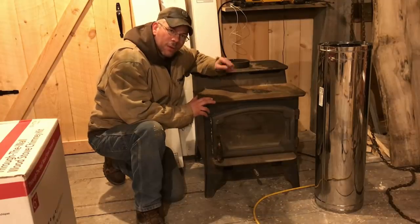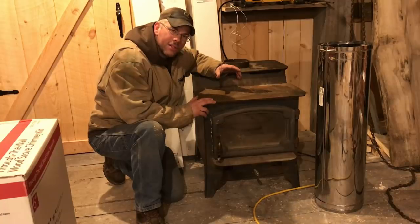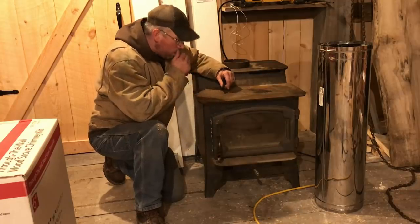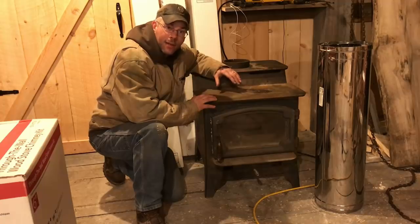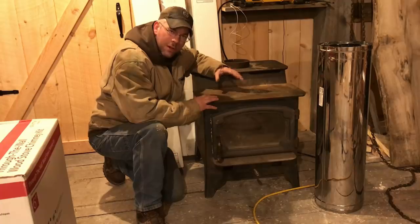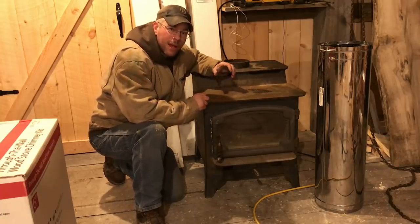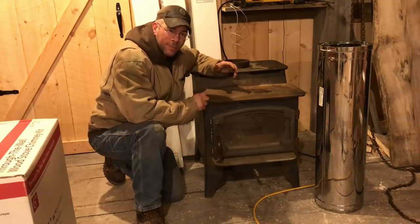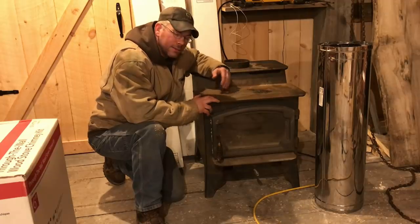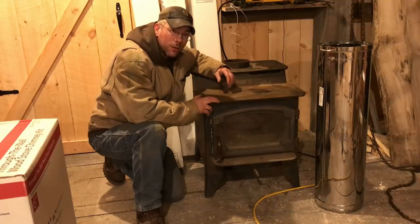The big sawdust burner we're going to put downstairs, because I have a feeling it is so big that it's going to kind of overpower this space a little bit. And I would much rather have that on a concrete floor, something with a little more protection when something goes wrong. Up here in a wood shop, if something goes wrong, you have a lot of sawdust, a lot of dry lumber, stuff like that. You have your polyurethanes, whatever you're using up here. You could have a bad situation pretty quickly if you don't have a good airtight stove and you've got sparks escaping, things like that.